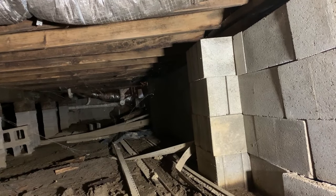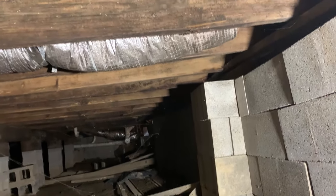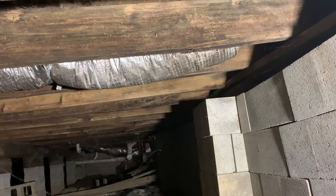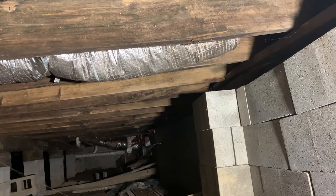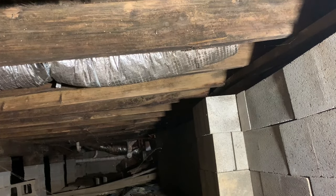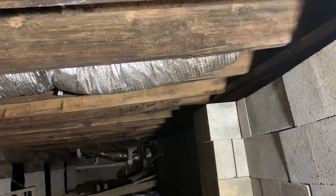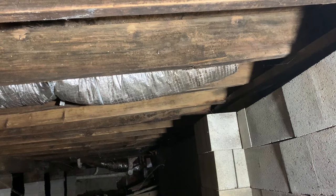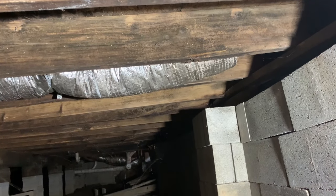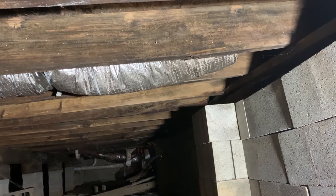You can see the piers, but they put them eight feet apart in most places and didn't bother to do any extra blocking in between. I'd much rather — if they were going to do pier stacking — they should have done it on four-foot centers, which is what I'm redoing it at as I go.